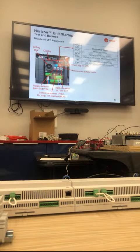Here is the Mitsubishi drive and the display itself. You have your run light. If the run light is lit, the motor is running. MON is the display in the monitoring screen. PRM is the parameter adjustment screen. PU, if it's lit, means the VFD operation is in hand mode. And then VFD operation, externally controlled, is EXT.